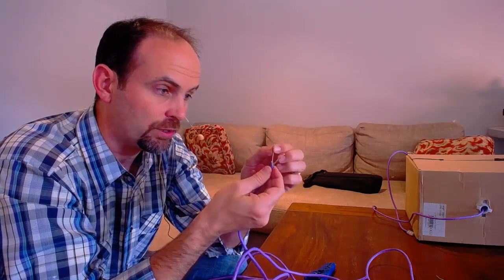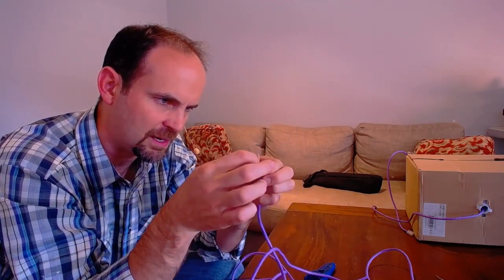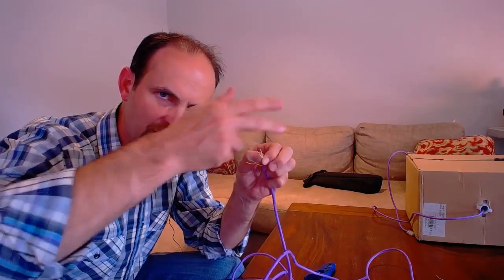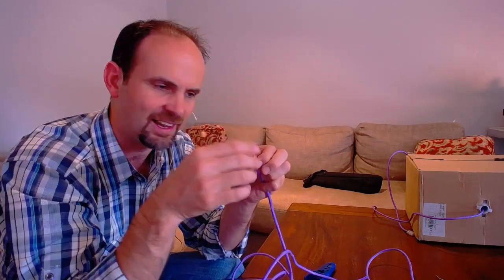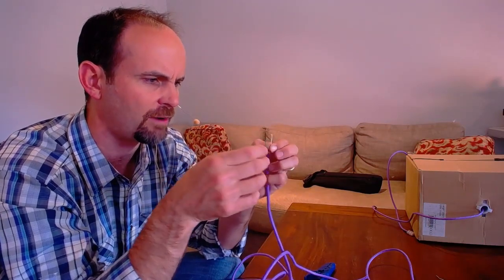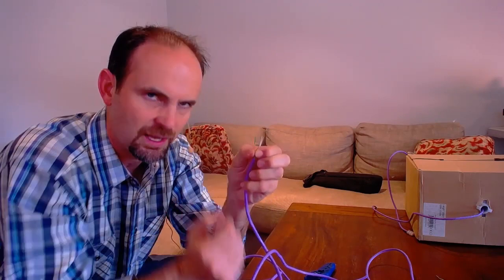I'm going to take orange stripe, that'll be the first pin of transmit. I'm going to make pin number two green stripe on both sides because that'll spin them kind of together as they're communicating. I'm thinking, if my brain is working right. Then I'm going to make green and orange solid, the other pair, which is going to be pin number three and pin number six, if you're talking about T568B, and kind of tie those together as the receive. And let's just see if, I don't know, that does something.